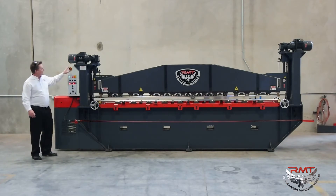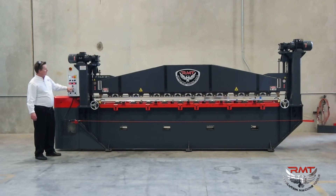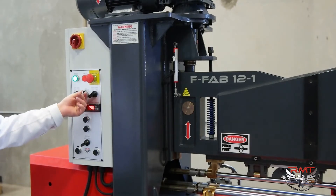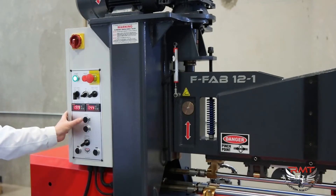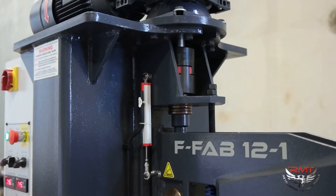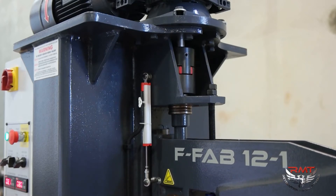You can see this machine — I've got drives on both sides, I'm able to lower it, I've got two-speed adjustment. You can see I've got digital readouts that show me my position or the radius I'm going to produce. I can also taper this, so if I want to move just my right screw, I've got digital readouts on it.